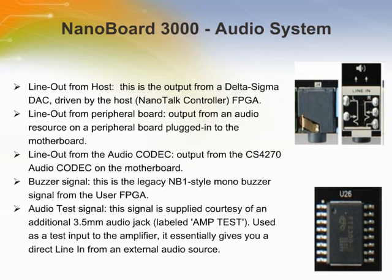The NB3000 provides a high-quality audio subsystem complete with analog mixer, power amplifier, and various sound output methods. The NB3000 provides a 3.5mm stereo audio jack for connection of an external audio device, labeled line-in on the board. At the heart of the audio system is a stereo audio power amplifier, a PT2300 device from Princeton Technology. This device incorporates stereo bridged audio power amplifiers capable of producing 2 watts output power into a 4-ohm load with DC volume control, powered by the motherboard's 5-volt power supply. The stereo amplifier in the output stage is formed by wiring two pairs of operational amplifiers in a bridged configuration.